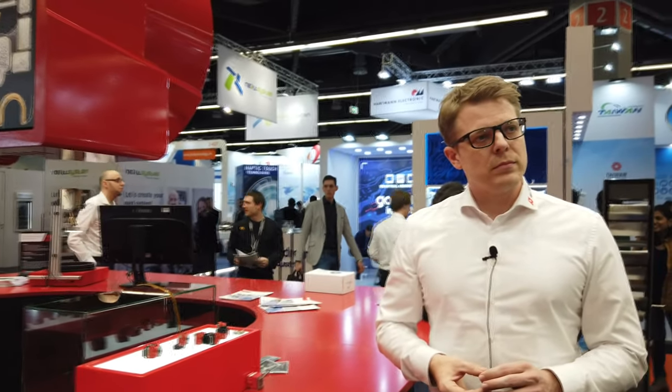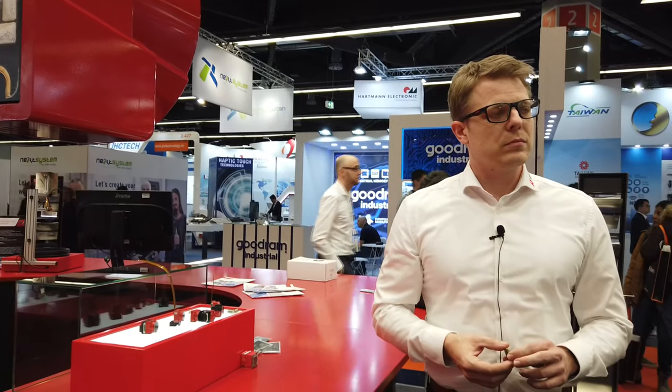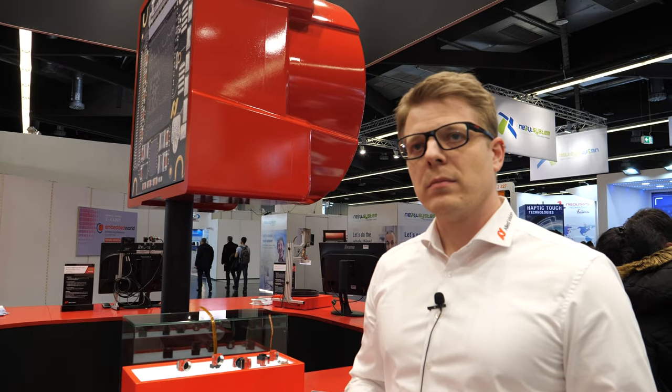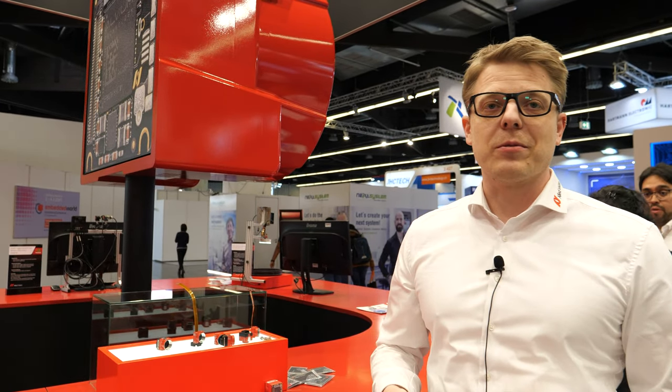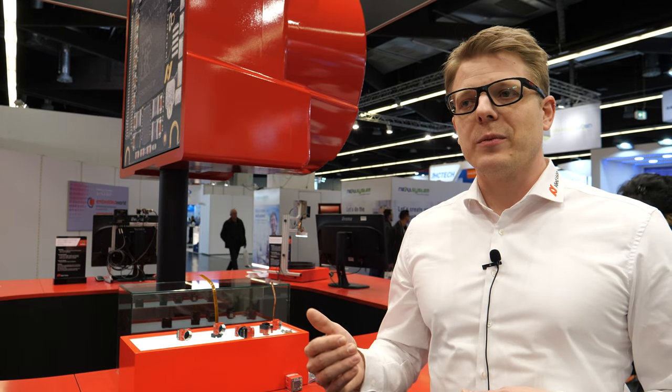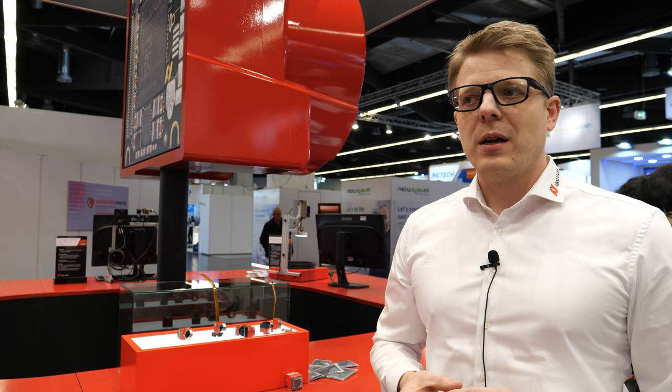How high resolution do you get? There's also a lot of new things with AI that allows for a whole bunch of new sensing happening through the camera that maybe before was not really thought of. And now if you plug it into some really cool new boards, you can do a whole bunch of new things. Deep learning is a very interesting technique, and there's a huge variety of problems you can solve with it. We come into play doing the right image processing — preparing the image so that the deep learning network has less to do and fewer calculations. It's very important that you prepare the image right so that your inference time running the trained network is much lower.